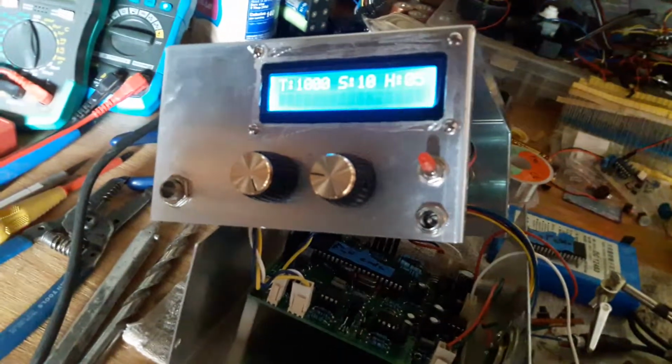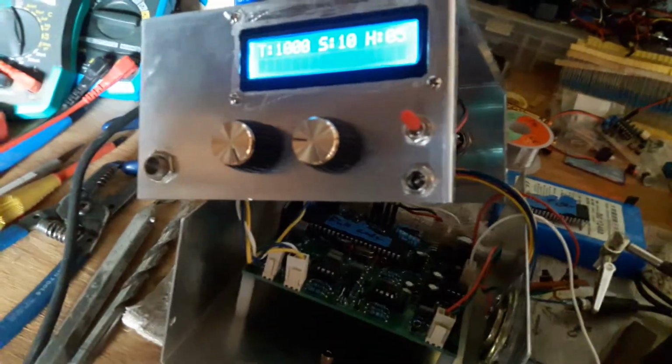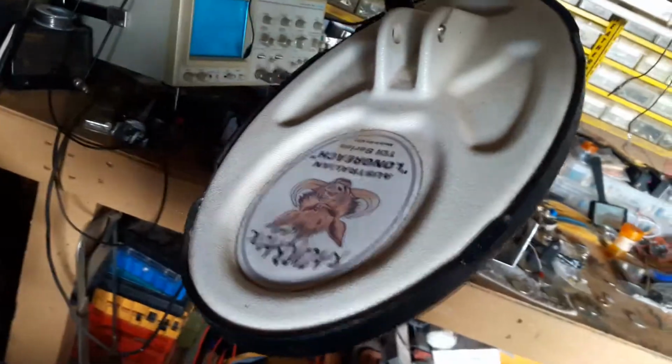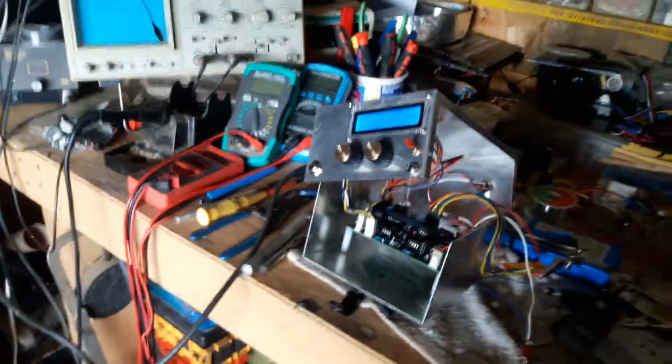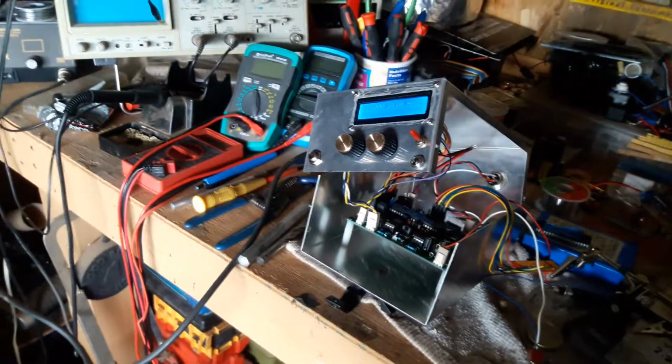I've changed it from the 250 to 100 to a 50 down to a 10, and I got 100 back in there right now, 100K. But anyways, as far as the detection, I'm using this coil right here, which is for a TDI, but it's a monocoil. I got it wired up for my detectors. So I've also been using this 3DSS. They're both between 306 and 320 uH. The 3DSS is 1.6 ohm, and this TDI coil is 2.1 ohm.